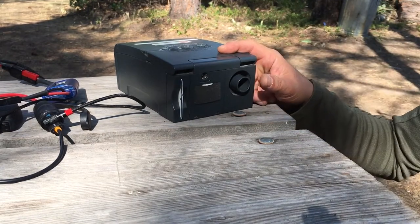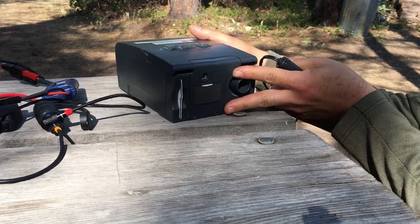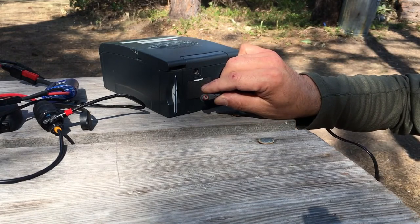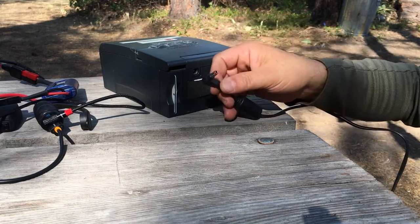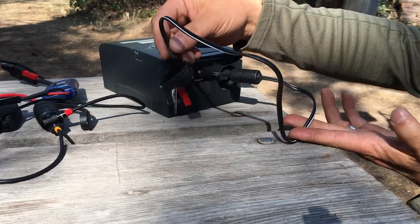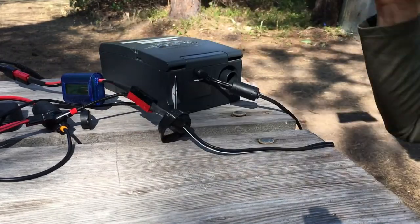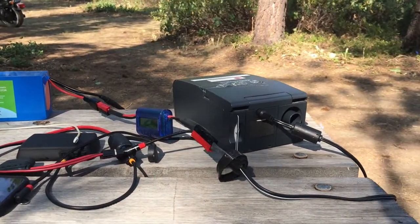In order to power the CPAP machine, I had to make sure I had a CPAP that could run off vehicle power directly without a transformer, for maximum efficiency. This is a Respironics Remstar Pro M Series. It's a little old, but you can run it off 12 volts and get connectors for it — which is really important because so many modern CPAP machines you're not going to be able to connect easily. This uses a 5.5 by 2.5 millimeter connector. I cut the cable at about 18 inches and put on an Anderson power pole connector to hook it up to this equipment. I can then connect it directly off the watts-up and power the CPAP directly off the lithium iron phosphate battery. That works great — you can hear it just booted up.